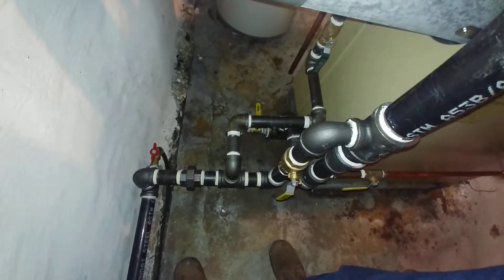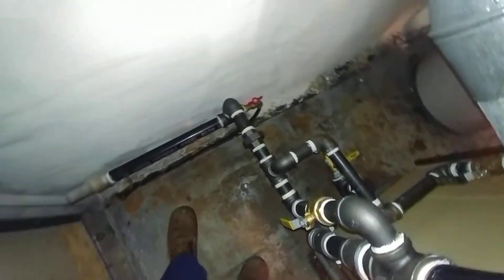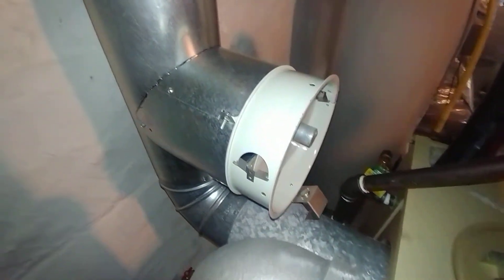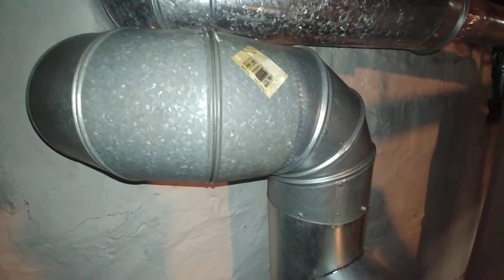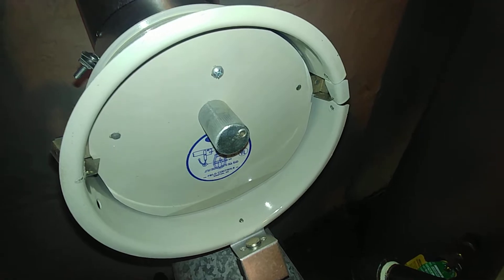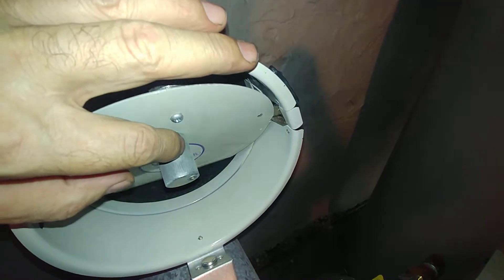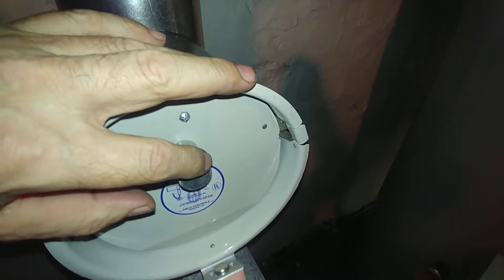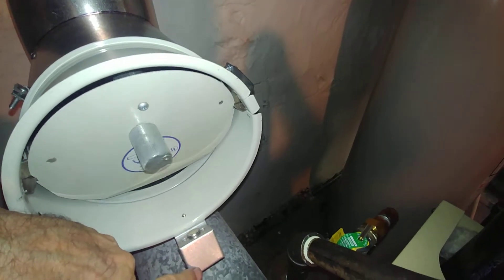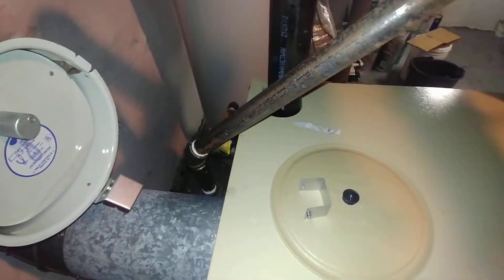This is one of the final reports on this boiler installation. We've got the flue installed and the barometric damper. Being gas-fired, the barometric has to be double-acting — not only does it swing in when excessive draft is required, but if there is a downdraft or a blocked flue it will swing out, and this temperature switch will be wired into the low voltage circuit to trip out and shut down the boiler in the event of a problematic draft situation.